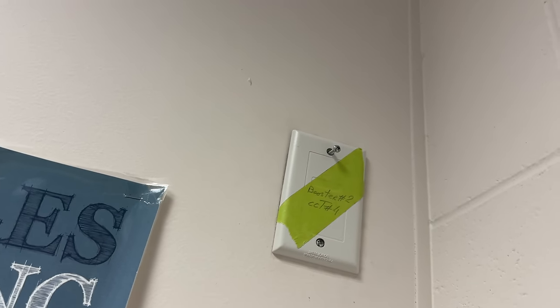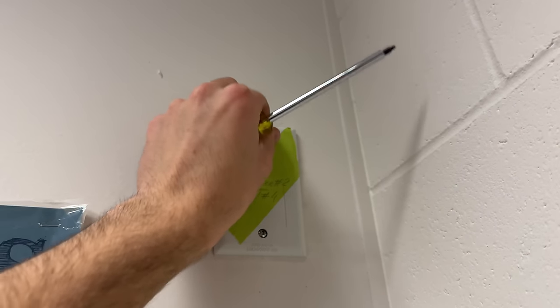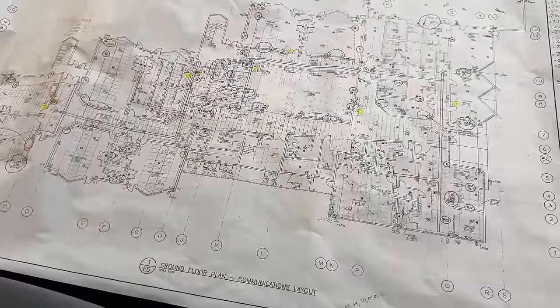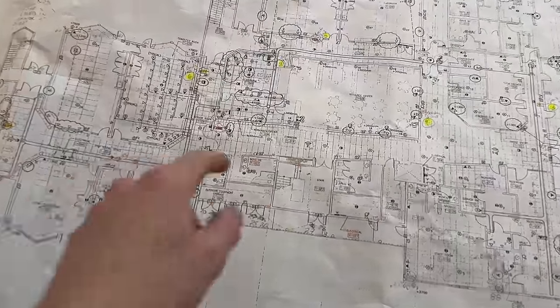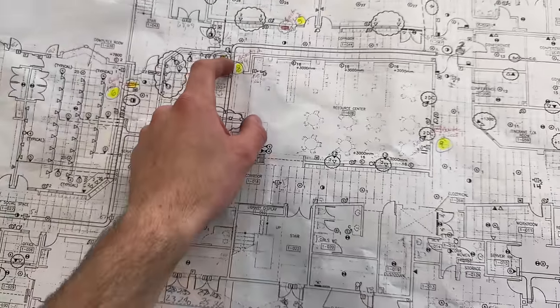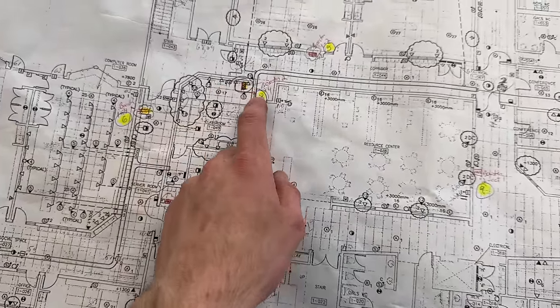The resistor hadn't been changed. It was like 15k ohms or something. I can't remember exactly what it was, but it was causing us a short circuit on the bells. So I'm trying to get all those sorted out now. Just change this to the new resistor value. Okay, I just went back to the panel, checked at the resistor here. That one has that short removed, but now I need to find NAC circuit 2.